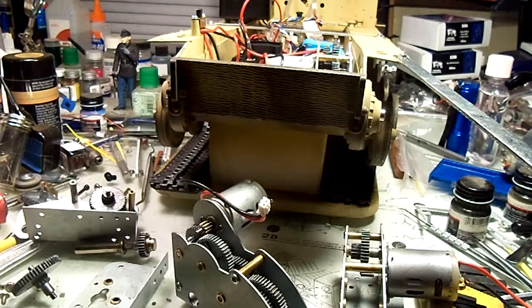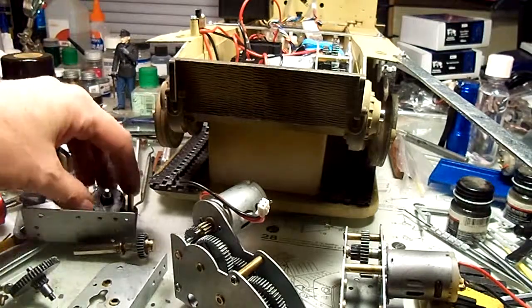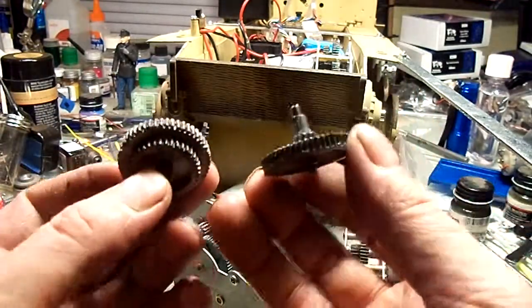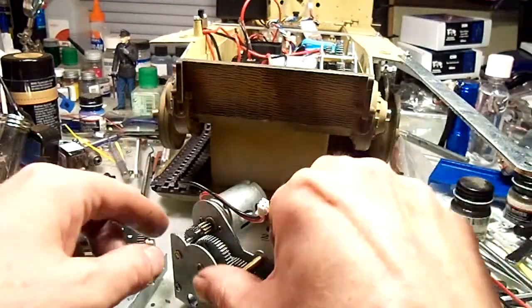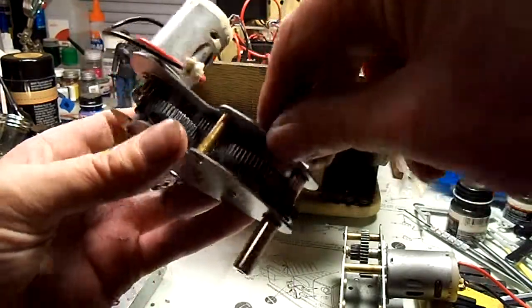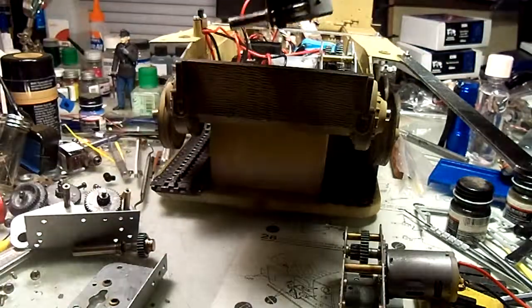And of course the configuration has to match too. For example, you can see that these two gears are obviously different — this one has a larger diameter here. Anyway, that's what we do. We just fixed a stripped-out gear motor, took it apart, swapped the gears. I decided not to use the black steel ones — let's burn up these first. I've got a few extra ones now.